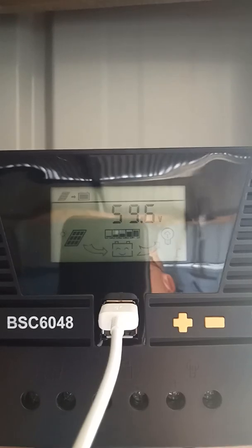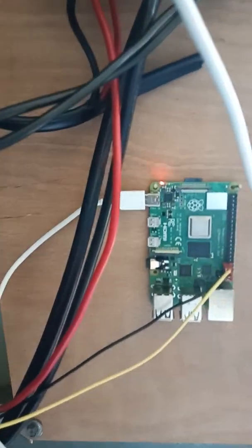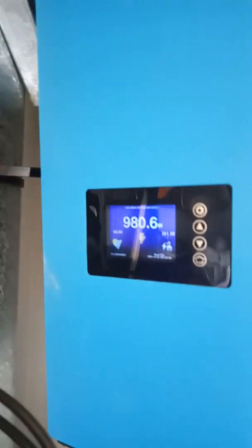I would highly recommend this unit — it's really really good. There's a little lamp post on the right side, and what that means is when it goes dark, this will actually enable this wire, and that goes across to here and then up to the inverter. So as soon as it goes dark, this circuit puts power onto this relay. But the relay doesn't switch on until my Pi tells it to. I look for when I'm drawing over 2.5kW from the grid — if I see more than 2.5kW, I turn that relay on, which gives me another 1.3kW from the batteries. It stays on until the load from the grid drops below 1000W, and then it switches off and preserves the batteries. It does that all night until the next morning.